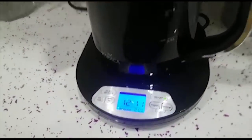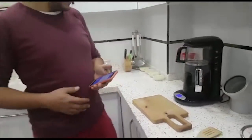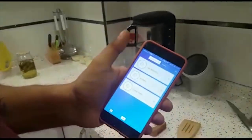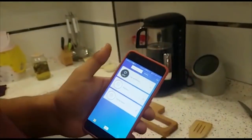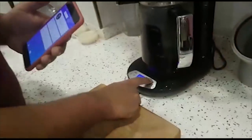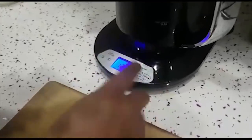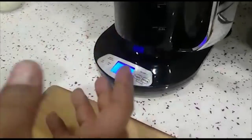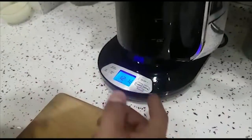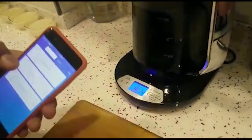There's only one small minor issue. This is not an issue, this is kind of an issue. Okay, now it's on. When I press off, it's actually not switching off, because I replicated that button. When I press that button, it shorts, but when you release it, it's not closing the circuit. So what you need to do is press here again, and now it's closed.